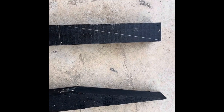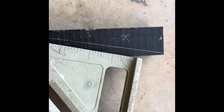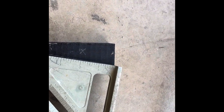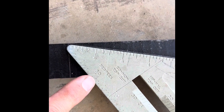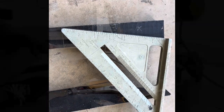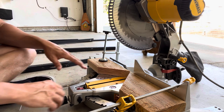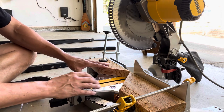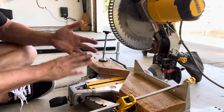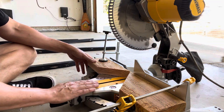If you want to forget degrees and angles, that's what you would use. To figure out 78 degrees, we use this pivot point on this speed square — put it right here in the corner of the wood and then angle it over. If you look down here, we've got 80 degrees, 79, and 78. So we need a 78-degree angle. This build is actually super easy, but we have one more thing to worry about: cutting this on a miter saw, which I would recommend. If you have a table saw that would be even better, but you could use a jigsaw, a circular saw, or a handsaw — pretty much anything. I want a really clean cut, so I'm using my miter saw.